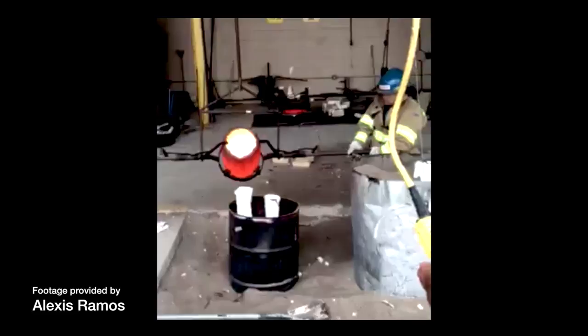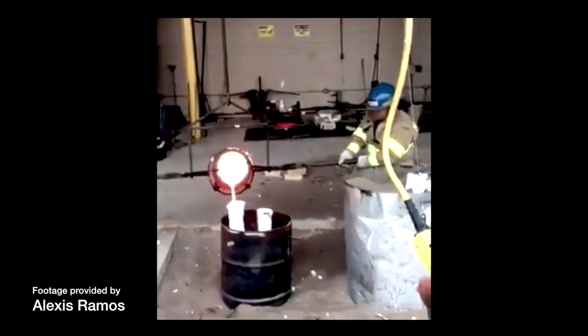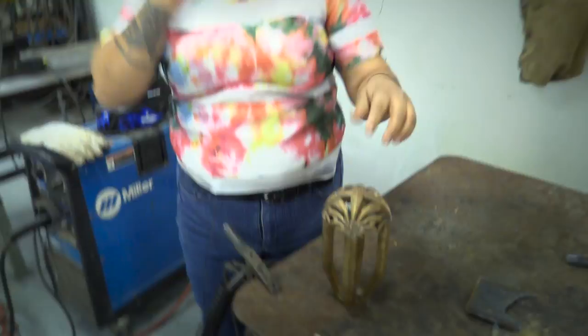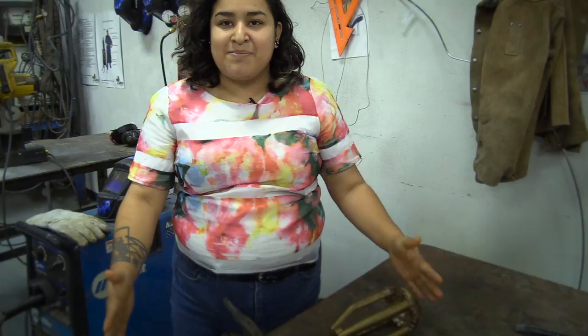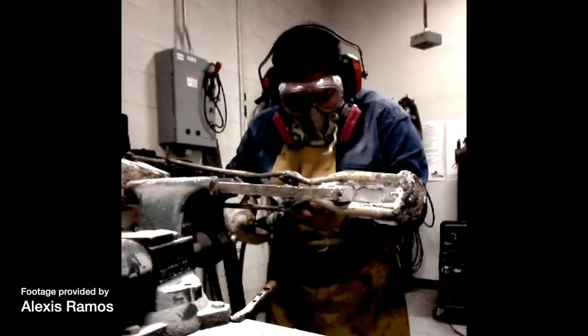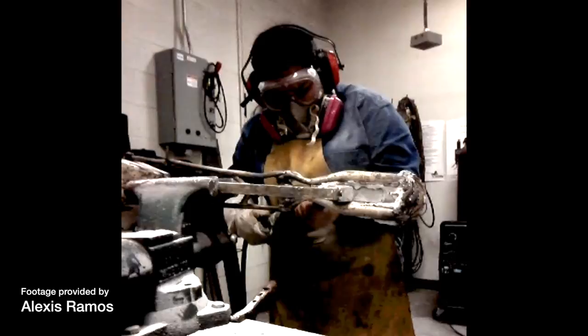Then I invert it to burn out the plastic and the wax, and replace it with metal to make a new positive in bronze. We're casting metal here at the university at temperatures up to 2,100 degrees and up, depending on the metal we're casting. It's amazing that we have a foundry of our size. One of the first things I did after casting this — he's actually attached to a piece of metal about this big — and I have to very carefully cut and clean it with grinders, plasma cutters, pretty much without damaging anything else internally. Then the tools start to get smaller and smaller as the cleaning begins. It's labor-intensive work on my side of it.